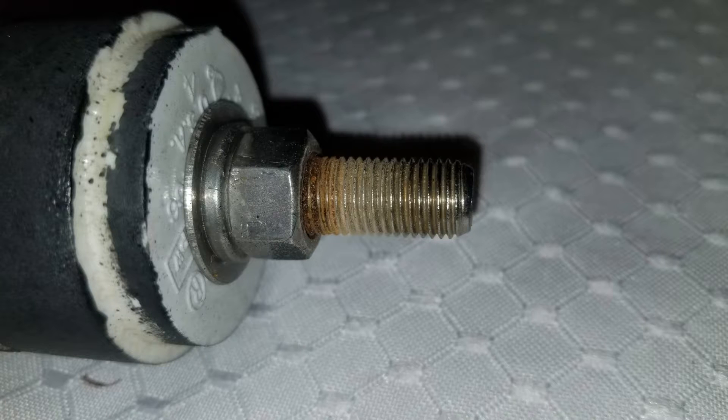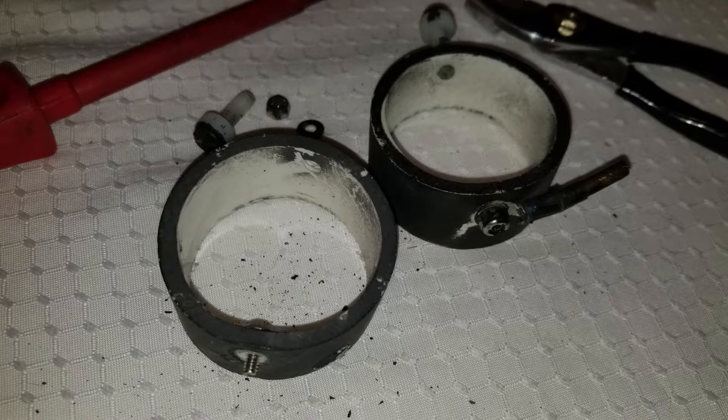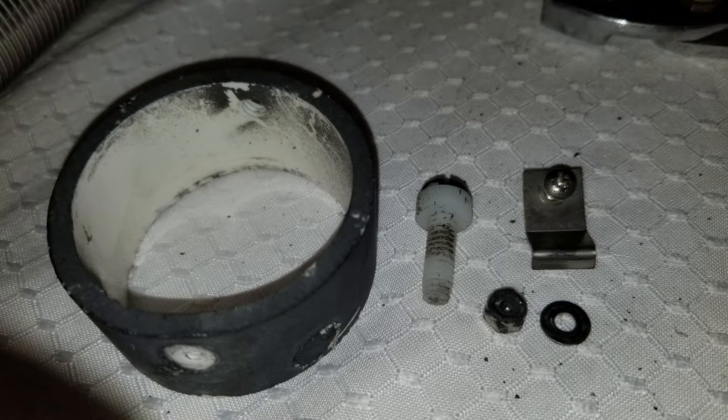The paint job was something else I wanted to address. I have the dual collar upgrade to this antenna, and I wanted to repaint everything. The folks at Wolf River Coils had also come up with a new pickup — the little metal bent piece on the interior that rubs against the coils and makes contact. They redesigned a newer, bigger piece to do a better job, even though the antenna worked well already. So I ordered the pickup upgrade kit, and I also wanted to redo the radials.